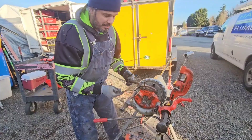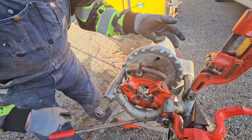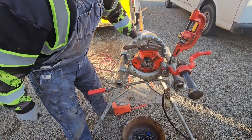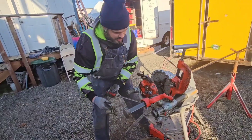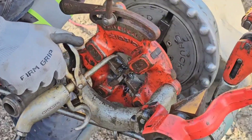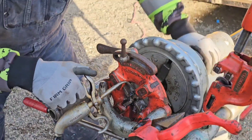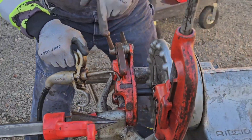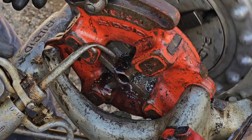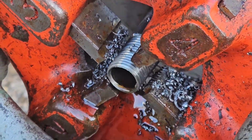I lower the die - look, here's the release, it even says it right there: open, close. Open the dies so you can slide freely over it, but to get started we close them. Now it's time to start threading the pipe - ready to go. It's just a constant beautiful oil. I'm going to let go with my left hand - I'm watching the threads and seeing when I'm one thread past, then I'll release it. Boom, I just stopped threading.